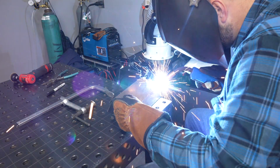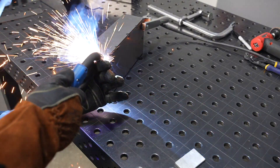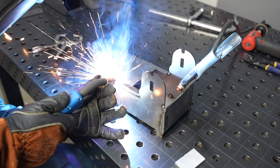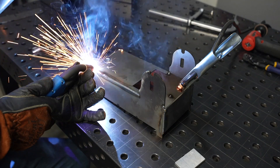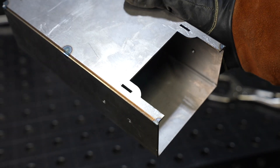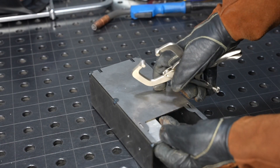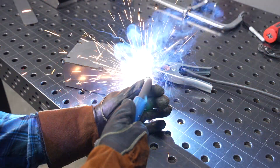If my wife watches this and sees me welding in this shirt I'm going to hear about it — this is one of her favorites. Now it's time to start welding these parts out. The majority of the welds here are outside corner joins and I'm just running a straight stringer all the way across — no manipulation. This lets me turn my settings up a little higher, move faster, and put less heat into the part, putting in a lot less heat than if you stack dimes. There's a very small amount of material next to the weld and I don't want that to warp, so I'll clamp some scrap aluminum plate right there to absorb the extra heat.